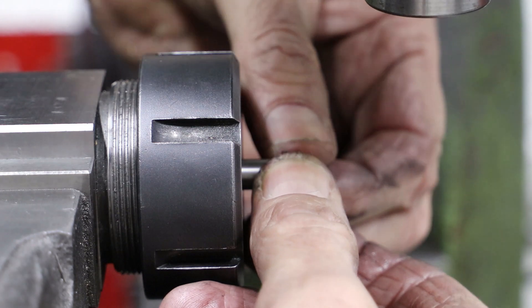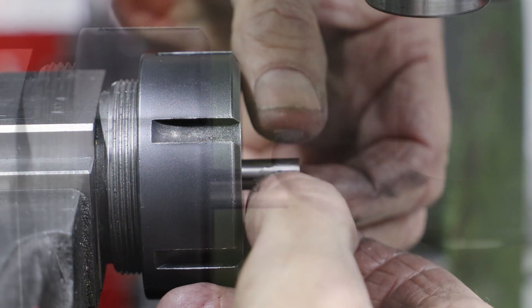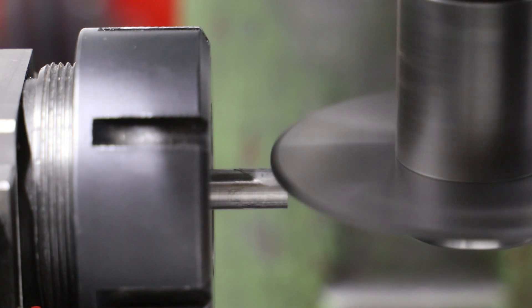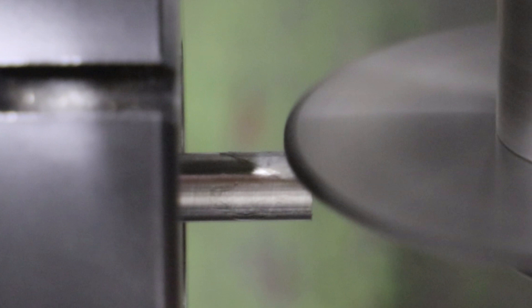For the slot I use a slitting saw. Before I do the cut I find the top of the bar using a piece of cigarette paper — otherwise known as Rizlas here in the UK — soaked in oil and stuck onto the workpiece. This is an old engineer's trick that I was taught years ago at college, but I've not seen any videos showing this approach on YouTube at all. To find the end I go with the more conventional approach of just touching off.